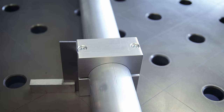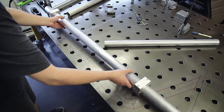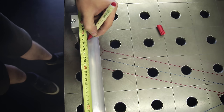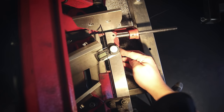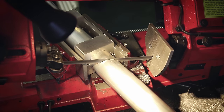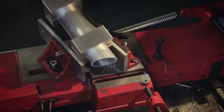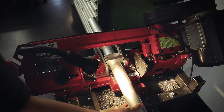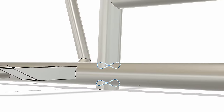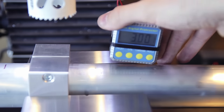For starters I'm cutting the down tube roughly to length, then marking the spot where I need to cut the first miter. To set up the saw I use a digital angle finder because I have to cut some pretty weird angles and this is more accurate than using the markings on the saw. I move the tube locks between cuts and line them up with the scribe line each time to make sure all miter cuts end up in the correct orientation. Next I need to create the hole that allows the steering tube to pass through the downtube — the steering tube goes in at a slight angle of three degrees.